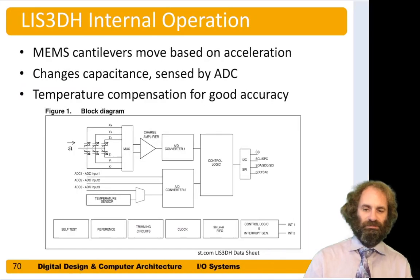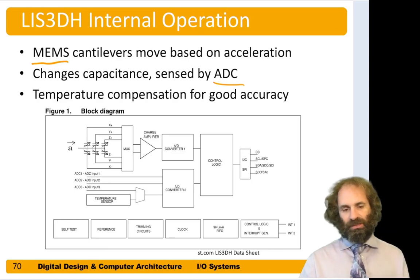Internally, the accelerometer is a pretty nifty device. It has micro electro-mechanical, or MEMS, cantilevers — beams of silicon etched out over a void in a tiny, smaller-than-a-square-millimeter piece of chip. There's a conductor on the beam and another conductor underneath the pit under the beam. As you apply an acceleration, the beam moves, getting closer or further from the other plate, which changes its capacitance.